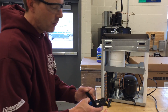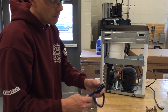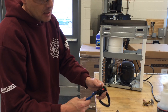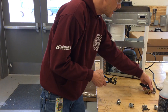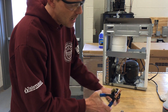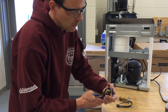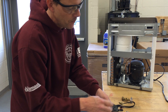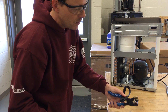There's also this one. If you're just going to be recovering refrigerant, this is an imperial tool. Most of them are to be used with copper or aluminum tubing only — this one's for copper only. This one has a needle right in here, and you would just crimp that around the pipe. Once you crimp and pierce the copper tubing, you would keep it locked in right there. This would not be left in the system. I would tighten this down with the Velcro, then hook up my gauge and proceed with the recovery.